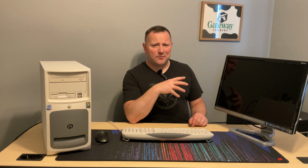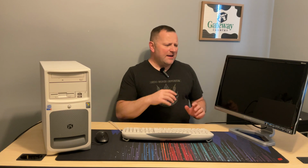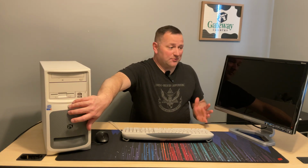I was able to install a regular 10/100 D-Link card that I had lying around, and I do have network connectivity on this thing. I was able to do a couple Windows updates via Legacy Update and got everything running great. Now, all the drivers except for the GPU were working without any changes. I didn't have to modify anything. All the drivers just showed up.